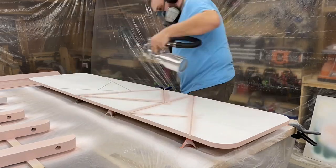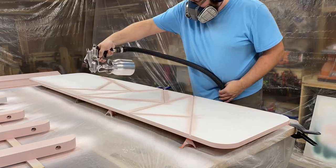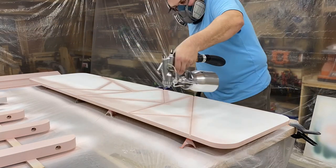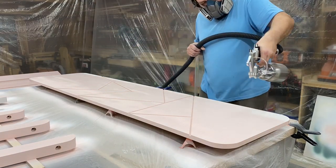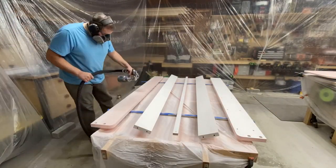It can be tinted to just about any color you choose, and is much thinner than latex, so it sprays like a dream, especially with my new Spray Port 6003 from Earlex. This was a recent upgrade from a smaller HVLP unit. It has so much more power. No thinning was required. It sprayed a flawless finish right out of the can.